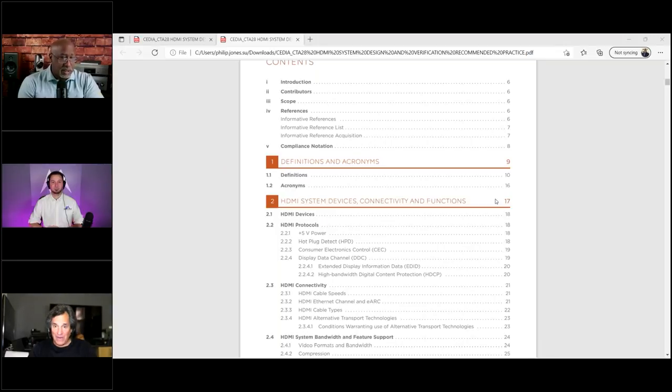Yeah, before now, I plug a projector in, I want to proof that system. I want to make sure that the source is going to be going through whatever switch, distribution amp, AVR, long, short cable. And by the way, let's mention something short, because Jason and I found this out the hard way. Jason and I have set up systems all over the world, and he's very fussy, especially since when he's sitting here doing the switching for us of 12 TVs and 5 sources, the back of the rack is facing the audience. So we actually got some very short little loops of HDMI that were just beautifully curved. Yeah, nice. Just little guys. Yeah. Laid out.